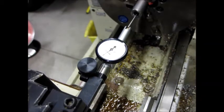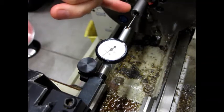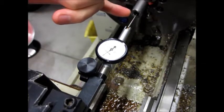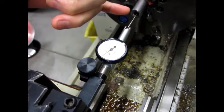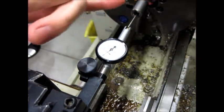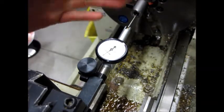I just got done finished cutting the crown, and what I'd like to do next is to chamfer the very inside of the crown where there are still burrs remaining from the last cut. When I did the 11-degree cut towards the inside, towards the diameter, there are some burrs remaining.